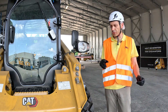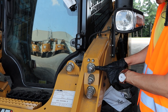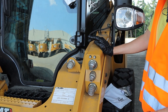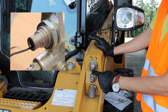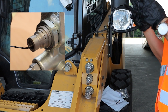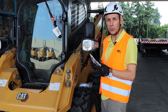With the machine on or off and the block not connected to any hydraulic attachment, you could experience a leak of oil from the male cartridge. You should first notice if oil drips from the front valve or from the back of the cartridge. If oil spills from the front, you need to make a specific maintenance to the seal that is behind this valve. So you have to retract this valve, block it as the video shows, and then take a look at the seal to see if there are traces of oil. Remove the blue seal and the backup ring and replace with the service parts — it's quite an easy operation to do.